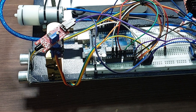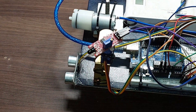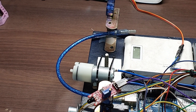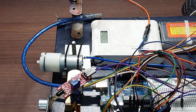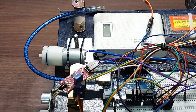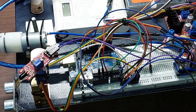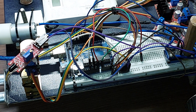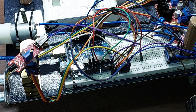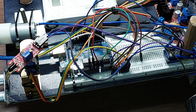If you do this approach there are a few things to be aware of. First, you want to power on the 5V components and servos before powering on the Arduino, because otherwise the Arduino will detect zero signal on the analog pins and just start going wherever it's pointed. Also, because we are using analog signals for both flame detectors and servos, you want a common ground. I have a ground wire coming from the Arduino ground to the breadboard ground rail, which syncs up with the ground from the flame sensors and servos.